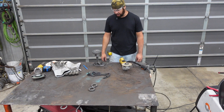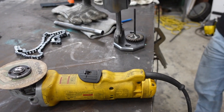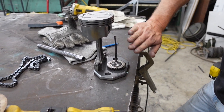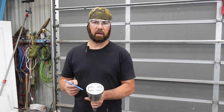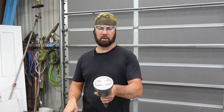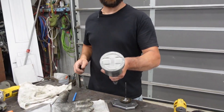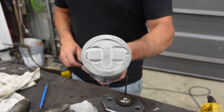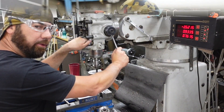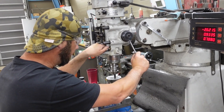It's part of being a machinist. Now we've got to cut a slot in the top — we're going to mill this out right here, slot it out that way. The reason I marked it was because last time I almost cut it the wrong direction, which would have screwed up the trophy. So mark things. Cover your tracks. Let's go get this cut. If I ruin this, we don't have any more pistons, so I've got to be careful.